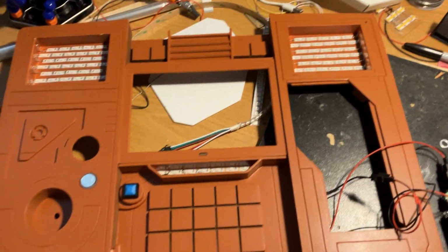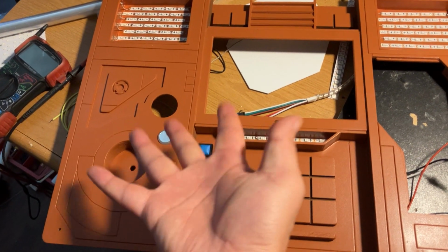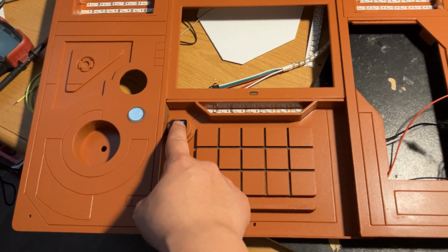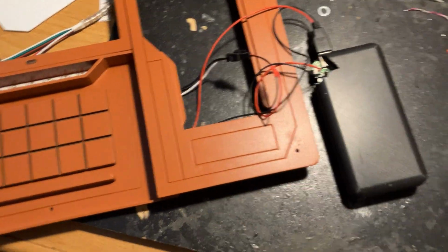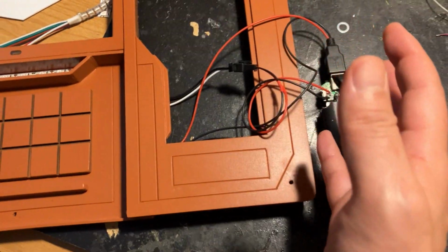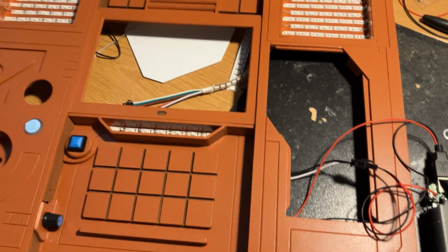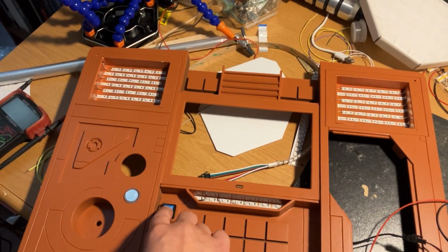All right, so there's 4 light panels. 1, 2, 3, 4. Kind of a light panel, it's just an indicator light. And they're all on the dimmer here. This is the main power that goes to the battery that I had to hack because it was just a tactile switch attached to the side of this. In order to get to it, I would have had to open the door every single time, so I just remoted a switch off to it. That's what this is. And then this is the USB that goes to all the 5 volt. Everything is 5 volt. So single push on.